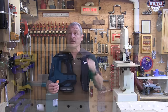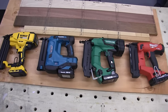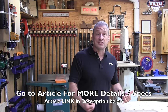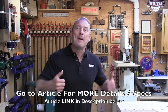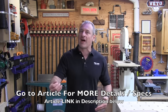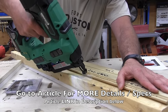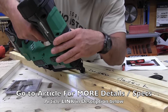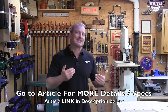We took a look at four major 18-gauge brad nailers and reviewed and tested them to bring you this head-to-head. Several test simulations we used are considered typical tasks for carpenters. These simulations include softwood trim installation to evaluate hole quality, hardwood trim installation to evaluate power penetration, fastener depth of drive, and hole quality. We also did a toenail application where we installed half-inch bead board into framing by toenailing the tongue on the trim.